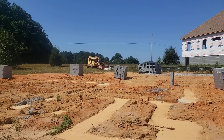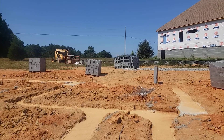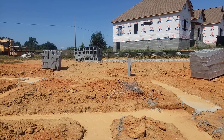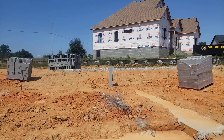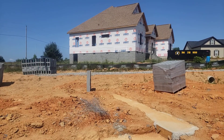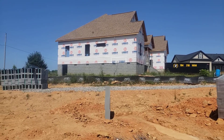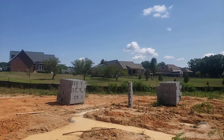We're going to have to put a lot of gravel in this garage, but it's a technique we use. We can come out with laser transits and all that, which we will do at the foundation. But this just lets me do it in the field so I can tell them how high I want this. Trusting my sight and instincts on this is something we can do, but I want the graders to come out because they have to make this work. I want to make what I have planned in my head consistent with what they have, because they grade all day long. What I don't want is to get a house built and realize I put my graders in a pickle because they can't make the water work. These are pretty subtle things, but they have to be thought out beforehand or you can end up with a real mess that's expensive to fix.